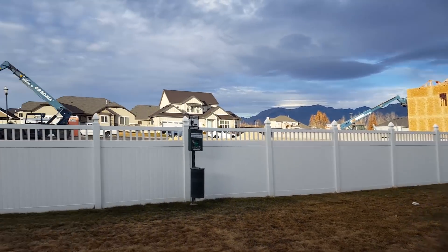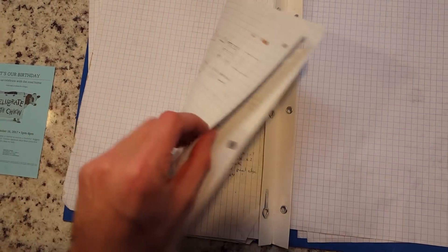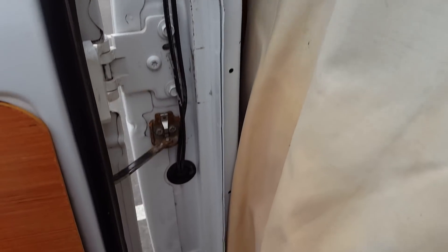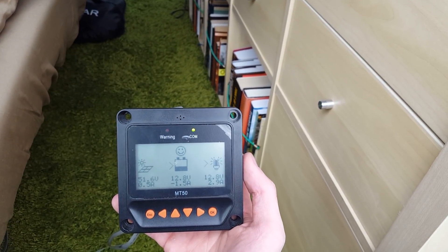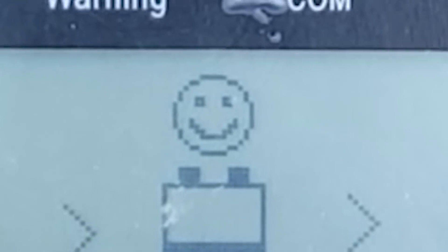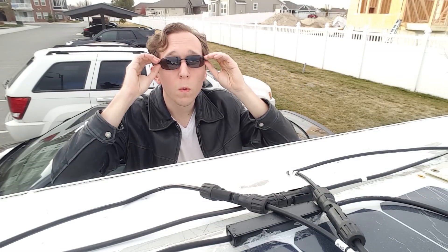They're really coming along. We went back to double-check the schematics — all artistically hand-drawn, beautiful. We've got the wires running down into the solar controller and it looks all good. We were at 14.7 volts with two panels, but now with four panels working we're at 51.1 volts, and it's even overcast, so we can probably hit 60 on a bright day. Now that we know everything's working, let's make everything look nice up here.